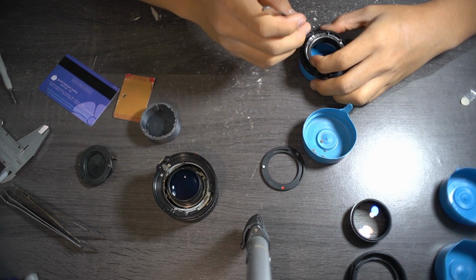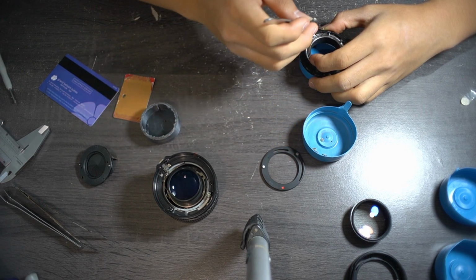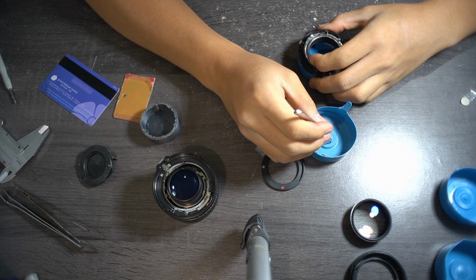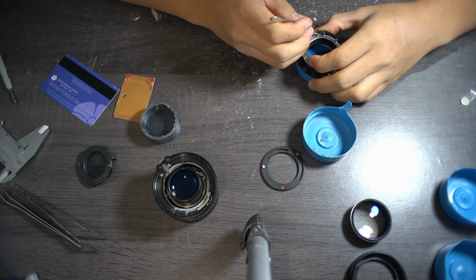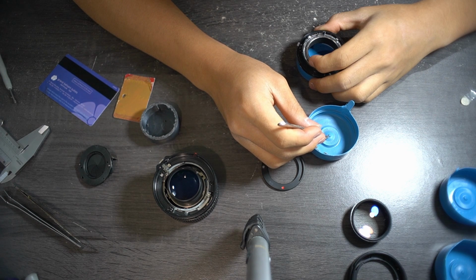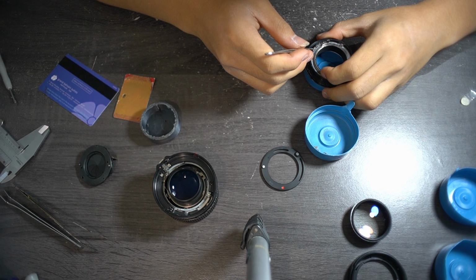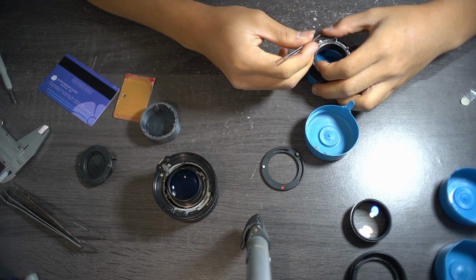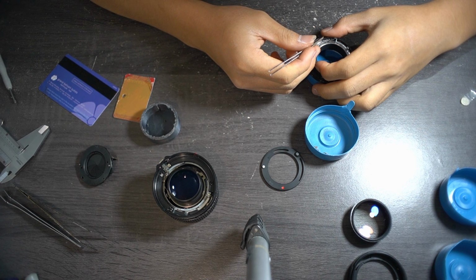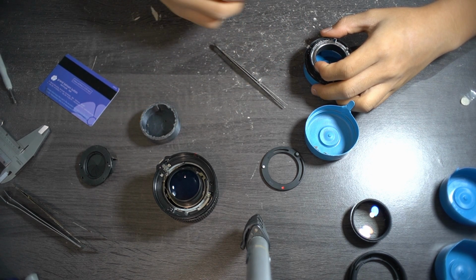Lesson learned: if you do not want to live a hard life, do not be a camera repairman. You can repair Helioses for your whole life and I wouldn't complain. I could take 200 of them per day, no complaints. But FD lenses are hell. This thing's a grease globe, which means it's held in by grease. You push the globe in, then push this rear bit. See? If it's even slightly magnetic, that happens. So you really don't want to use something magnetic for this.